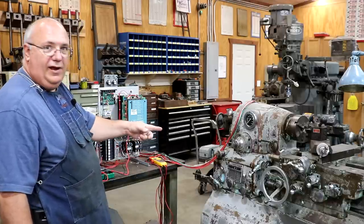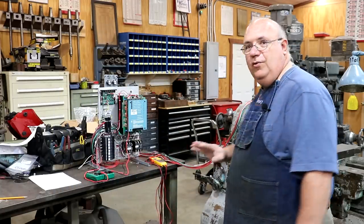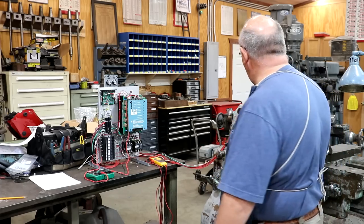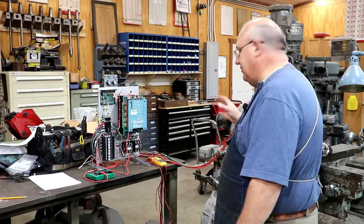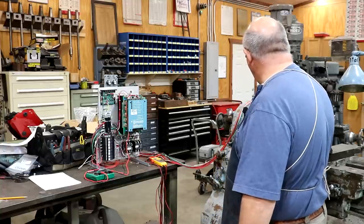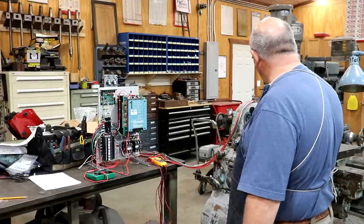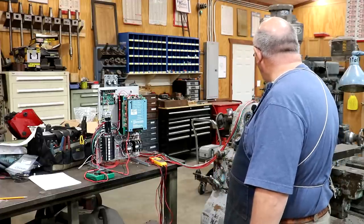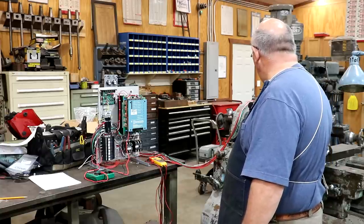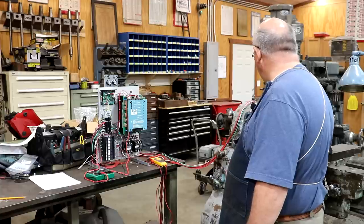Over on the lathe, we're using the lathe controls. So here's the drum switch for the controls. I will tell you right now that I've got to change some wires. It's actually spinning backwards from the way it should be. It's just flipping a couple of wires to fix that. We haven't done it yet. But when you take the lathe forward, it's actually spinning in reverse, but again, no big deal. Go back to off, speed goes down, and then go the other direction. There we go.